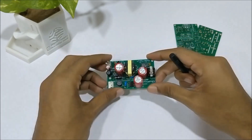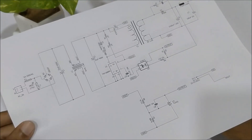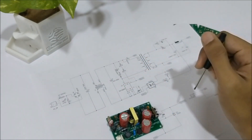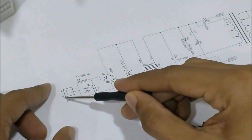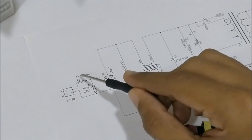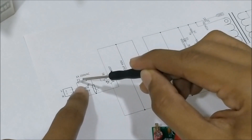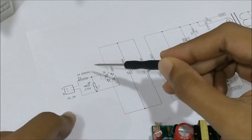To make things clear, let's take a look at the circuit diagram. Starting from the input section, this board not only converts your AC voltage to 12 volt DC, but it also has some protection features. On the input side we have the AC input voltage — the line and neutral of your power socket — which then goes through a fuse and an MOV. MOV stands for Metal Oxide Varistor. These two components together form the input surge and fault protection. Whenever there is an overvoltage, the MOV forms a short, increasing the current in the loop, and the slow-blow fuse blows off to protect the circuit.